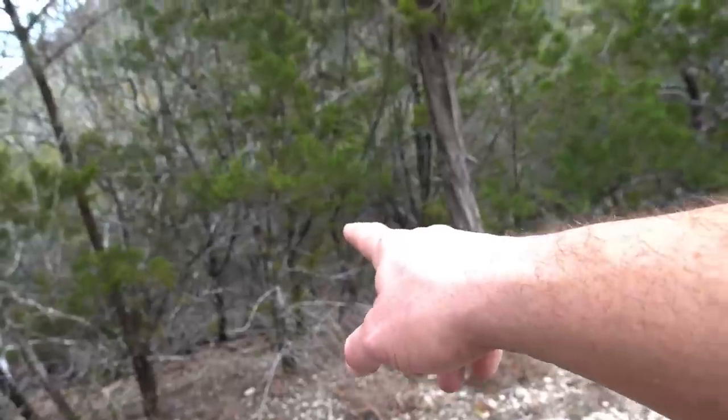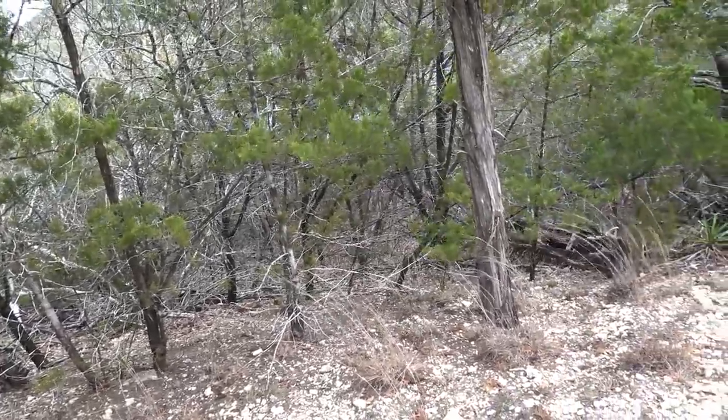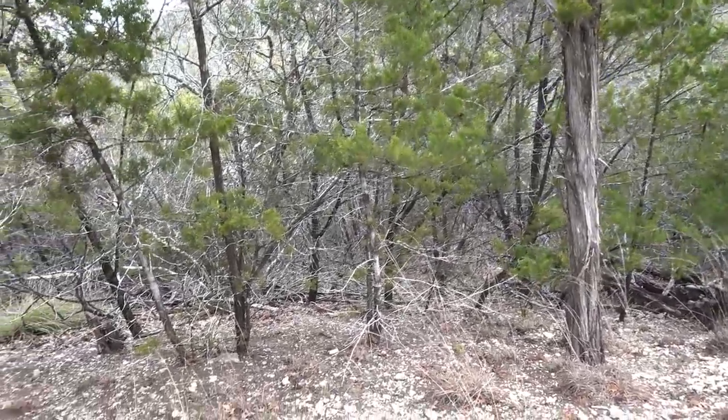All right, I'm gonna go look over there because if I can get 10 feet higher, that does add a lot of pressure. It's probably worthwhile. The ground's a lot less dirt here, a lot more rock. And then I have to snake a pipe through all that, which is super thick and twice as far for 4 more PSI. And actually there's gonna be a little bit of pressure drop just because it's a longer run, so maybe it's not even 4 more PSI.